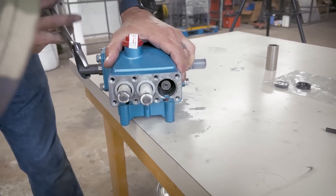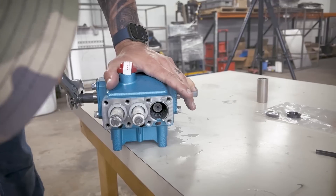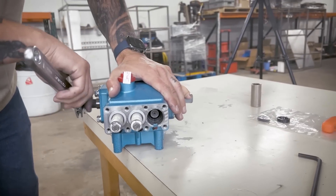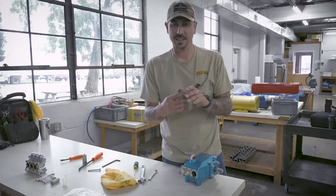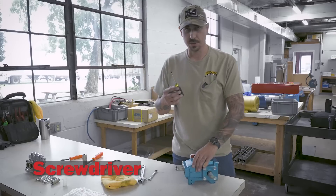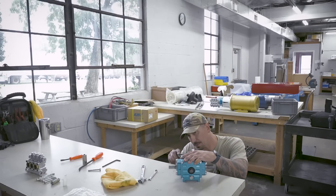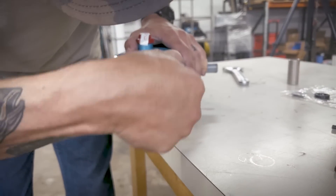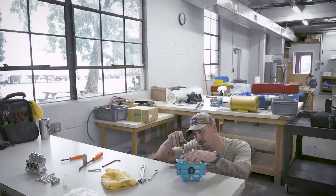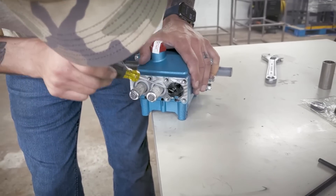I've turned the shaft so that the crankshaft push rod is back seated inside of the oil seal, creating a lip gap so that I can get a precision screwdriver back in there. What I'm going to do is just wiggle that in between the two, put a little pressure and give it a twist like I'm turning a screw. I'm going to do that in a couple spots and that's going to give me that oil seal out.